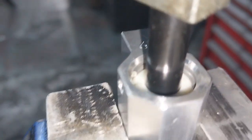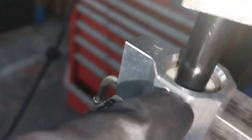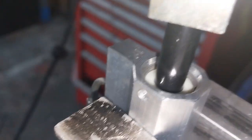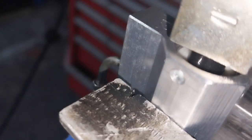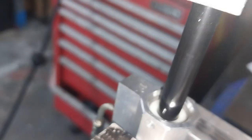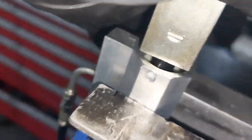You then push the clip around and then you can actually push something into that hole and pop the clip out. Obviously when you're drilling and when you're doing the pushing of the clip, make sure the rod is all the way down — not up in the air like that — because if it's an overshoot while you're drilling, you'll drill into the rod and mark it. So make sure the rod is all the way down before you start your drilling.